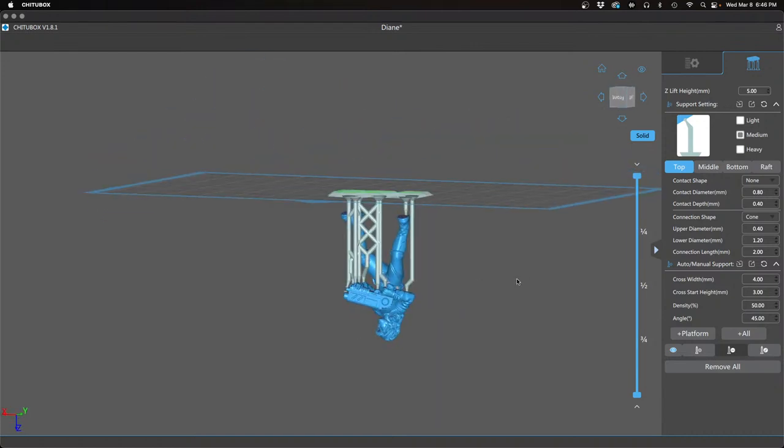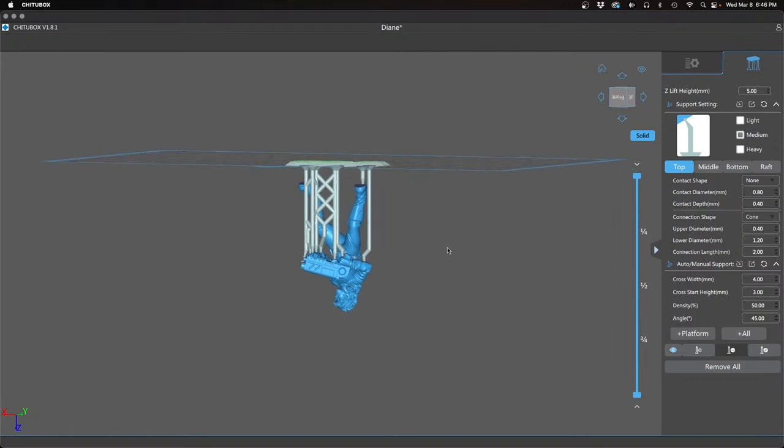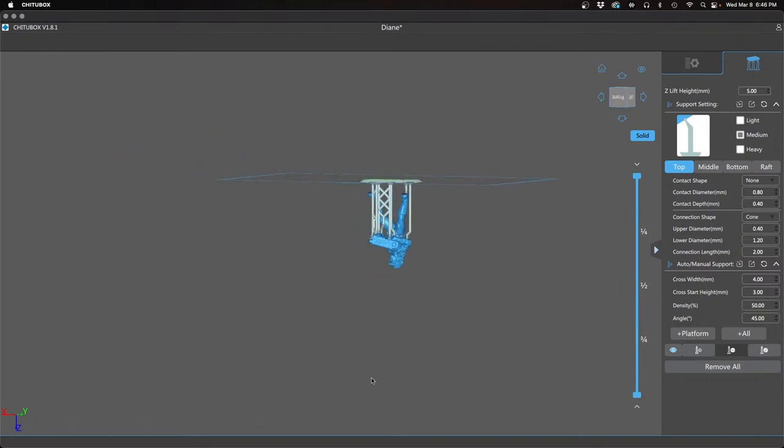the model is actually built like this on the print plate. Okay, so when you're looking at your 3D printer in this area, the vat of resin is going to be down in this area underneath. Okay, so the build plate will be down. This is the build plate that moves up and down in the 3D printer. Okay, so this will move down into the vat. The light will shine up from the bottom up to the build plate where the resin is inside the vat, and the light will shine there, cure the resin on it, and then it'll move up one layer at a time until it builds all of this.